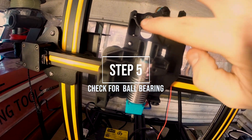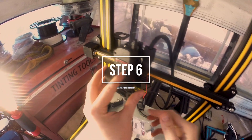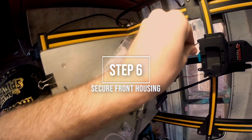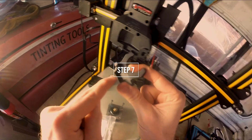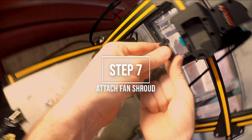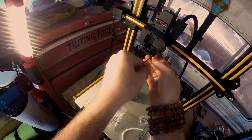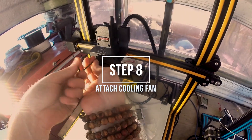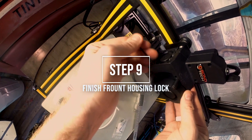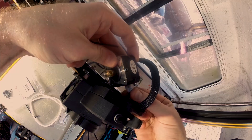You want to check your bearing — there's a ball bearing right here. Sometimes it can get messed up on shipping and be stuck, so make sure it's properly seated. Then put that housing back on and screw it on down nice and snug. Now we're going to add the fan shroud — it'll only go on one way. Line it up and put those M3 bolts in there, then put your cooling fan down in that hole and put those screws in. Put the last screws on the side to lock it all up nice and tight.